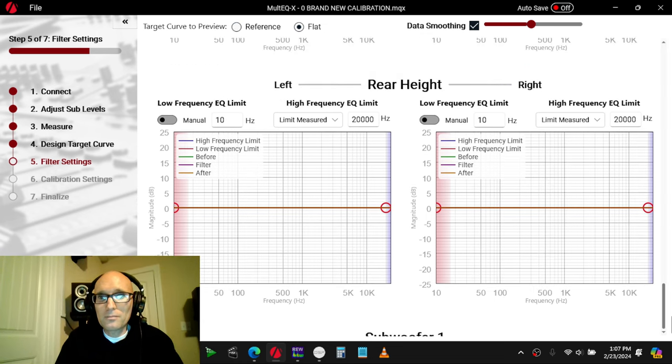So we're optimizing for different spots and places here. Blue is highest at this problem area as well, which is something to think about. 78.8, 79.9. So wait, whoa. That's 0.9, that's 1 dB's difference. Now we're getting into the strong sub bass area, right? From 60 to 50 hertz down, we're actually getting into strong bass there. This nasty problem we've got going on here.